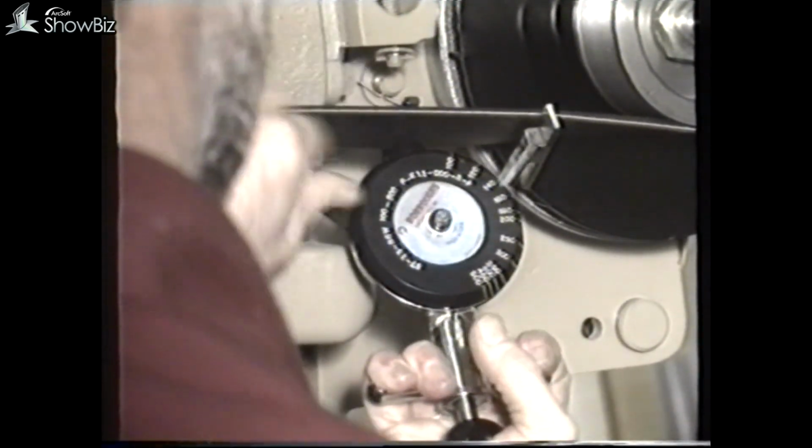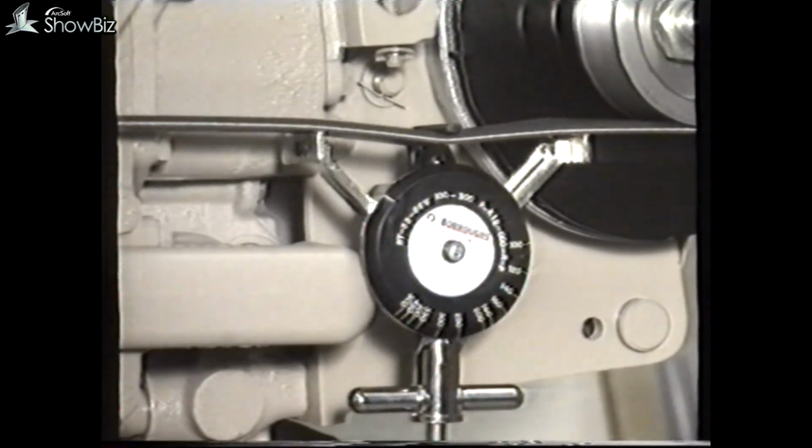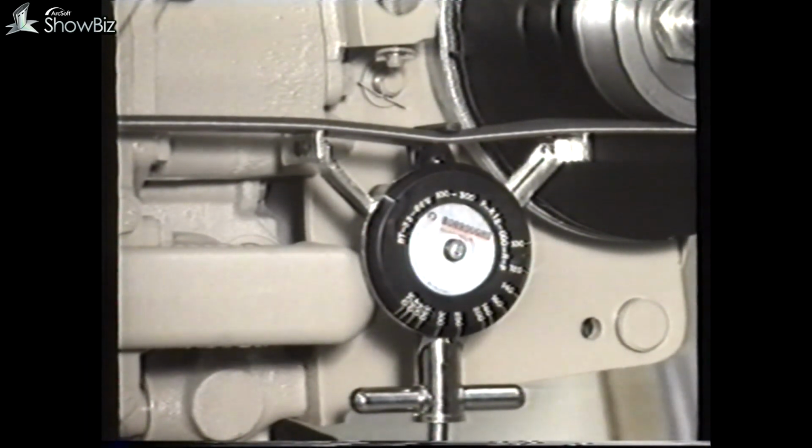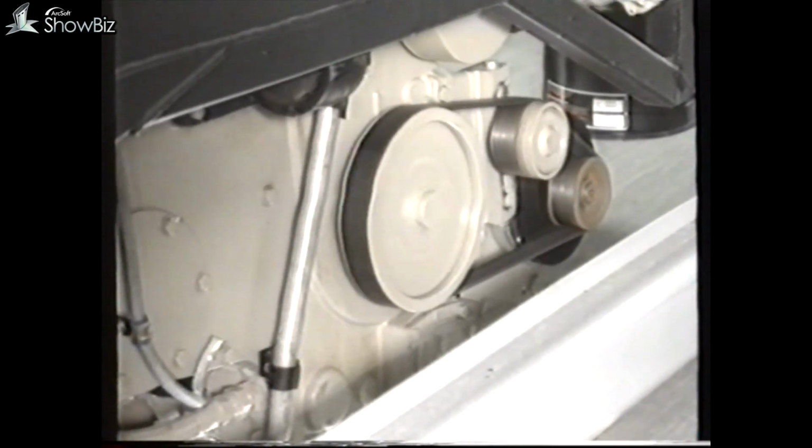The gauge should be located in this position on the belt. For reference, the belt tension should be set at 9 kilograms per groove. In this example, we have a 10 groove belt and should therefore be set at 90 kilograms on the gauge. If a new belt is installed, be aware that it stretches rapidly on initial running. Therefore, run the engine for 10 to 15 minutes and recheck the adjustment.